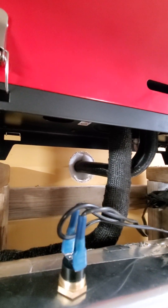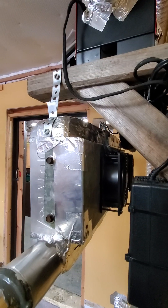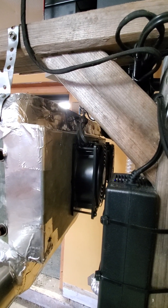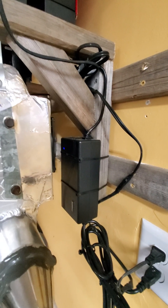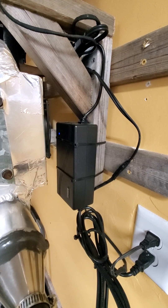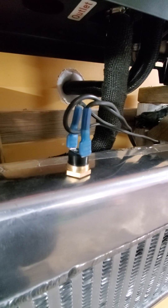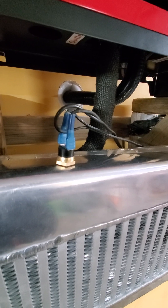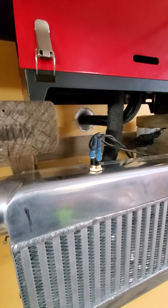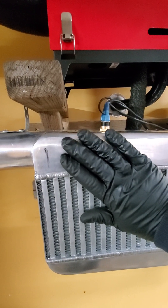The intake for the heater is through the wall there. I built a manifold out of sheet metal and attached a couple of fans — a little bigger than computer fans, I don't know the CFM but I got them on Amazon super cheap along with a 12-volt power supply. I went with a thermostatic switch, automotive style — it comes on at 180°F and goes off at 165°F. I'm not 100% sure that's the exact temperature range I should be using, but it works. Right now this part of the intercooler is super hot to the touch.